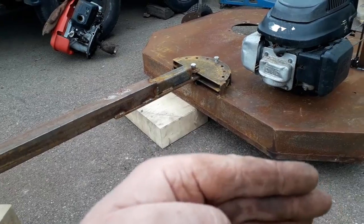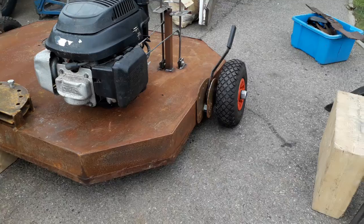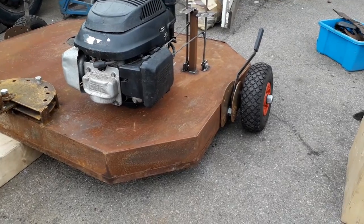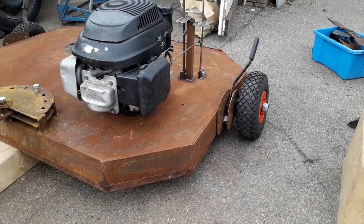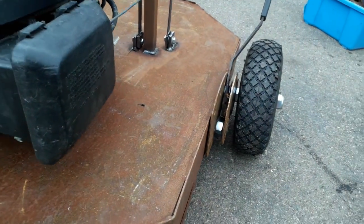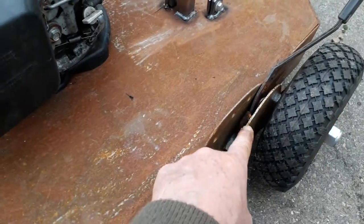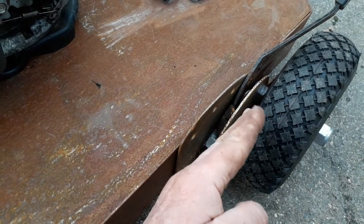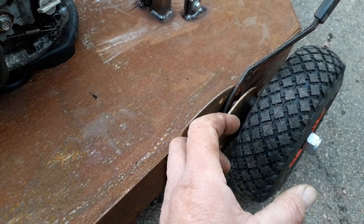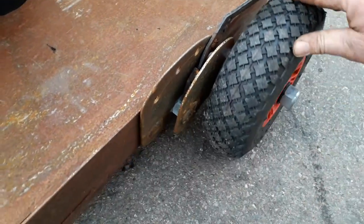I've made the wheel adjusters - I've just borrowed these wheels off the guy at the mower shop and they're not quite big enough what I wanted. I've mocked up the brackets but they need to be a heavier gauge, because this piece here which is the adjuster is flexing. And because there's a bearing in the wheel, the bearings have got that little bit of play so the wheels are a little bit floppy at the moment.